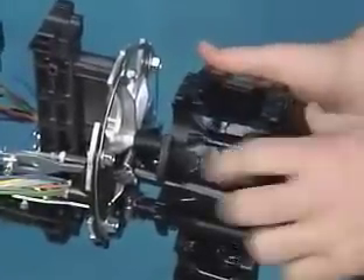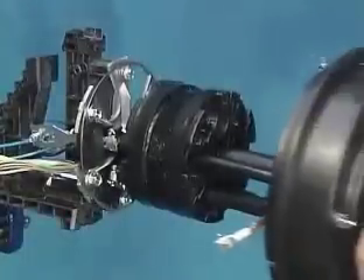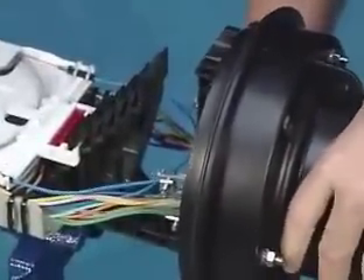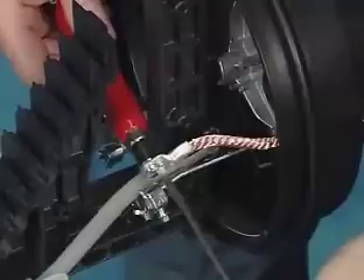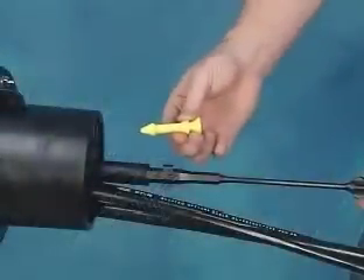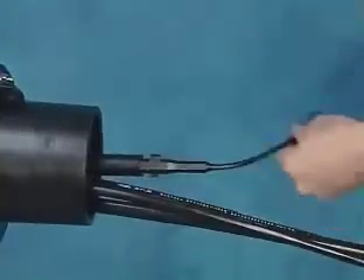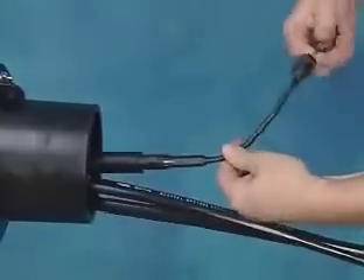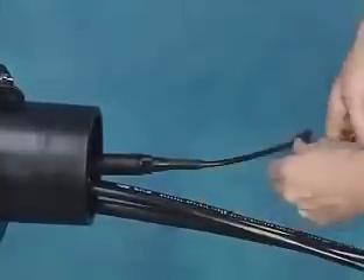Close the gel block and snap it together. Slide the base up and around the gel block. It's important to note the base must be aligned properly to fit the star bracket. Being sure to orient it to the proper position, slide the base onto the gel block and star bracket and secure. If grounding is used, connect the previously installed ground wires from the cables to the ground wires in the base. Add highly visible yellow port plugs to all unused ports. Grasp the gel block tail and move it to a position to allow access for tightening. Twist the tail until it can't be turned anymore or until it hits the built-in stop. You can use a screwdriver or similar device placed through the hole in the tail to make it easier to turn. If necessary, a wrench can be placed on the gel block to tighten.